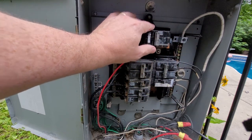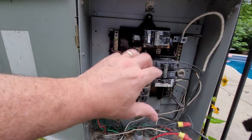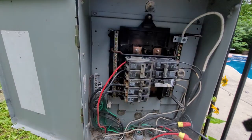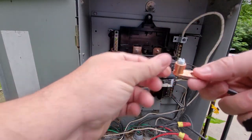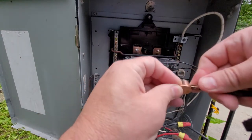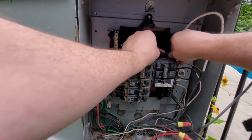I'm okay doing that for a week because everything else — the pool pump, the booster pump, the hot water heater, the light, and the electric switch on the other side of the pool — they all already have their own breakers. So basically you would take the wires off, unscrew these bolts, and this breaker just comes off — it's very easy. What I did to hot wire this was buy these things called lugs. All you do is take the two cables and put them into this lug, then tighten the cable onto the lug by screwing it in. Then you connect each lug like this.